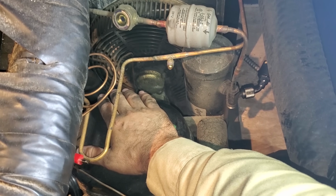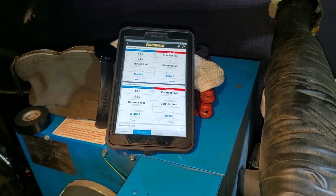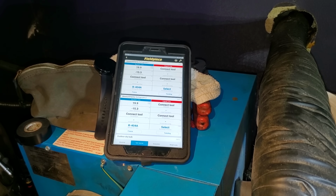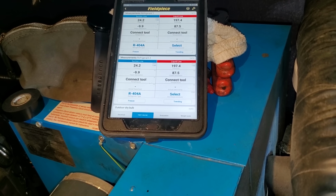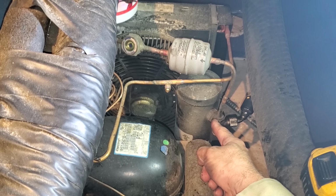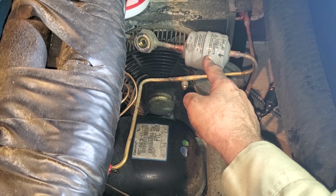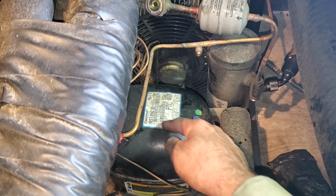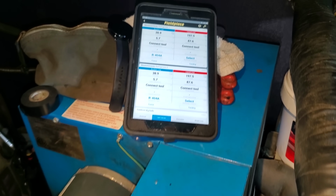Man, we got a compressor that's going bad. It shouldn't be rising that fast. Because it should be stopped coming out of the receiver right here. There should be no refrigerant in here, and the compressor, basically between the discharge reed and the suction reed, should not be allowing gas to bypass through. There's nothing else in this system that would allow gas to bypass through.